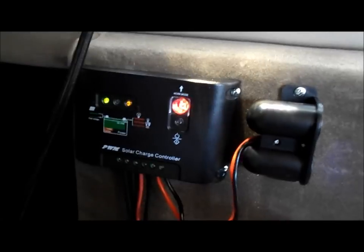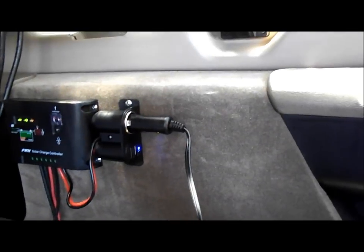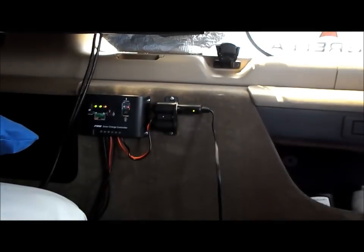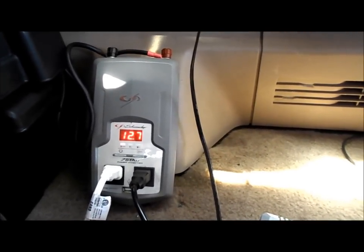Since I have a 100 watt solar panel and this output is only rated for 130 watts, you don't want to use over a 100 watt accessory on this charge controller. Now check this out — 13.8 volts right now. I'm going to plug in my air conditioner to this direct solar output. My AC is running right off the solar panel. See, the voltage isn't dropping under 12 — I could run this all day right off the sun.